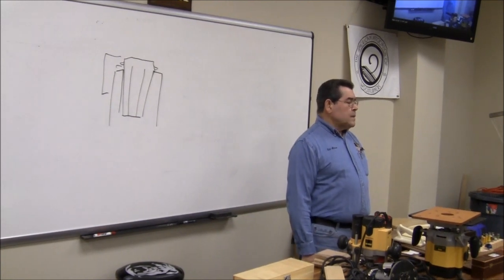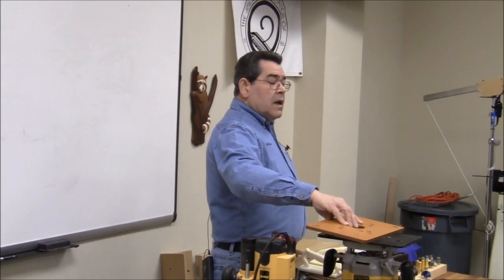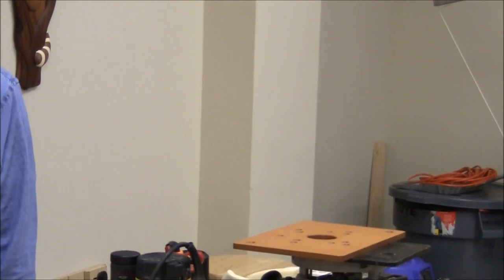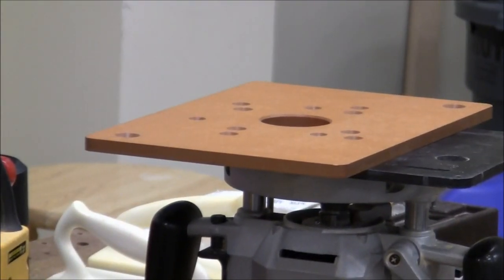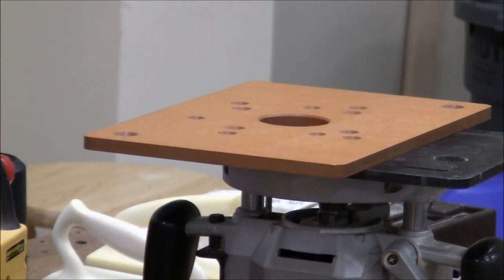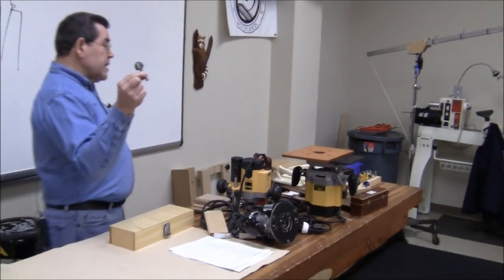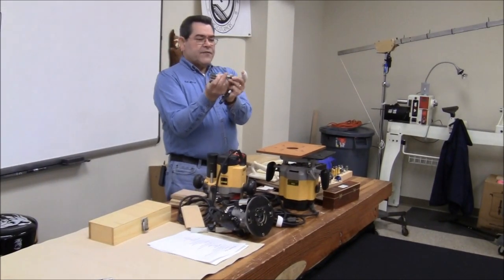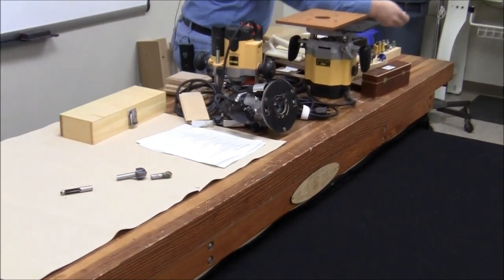If you go to an aluminum plate, they'll be thinner. Acrylic will be thicker because it's more flexible and you need to prevent it from sagging. But it's generally not a problem. If you're using a big straight bit, you've probably got more bit than you need. You can get longer bits and pay attention to buy bits that have fairly long shanks — they come with all different lengths.